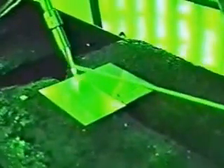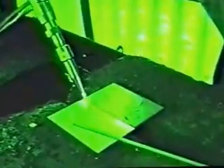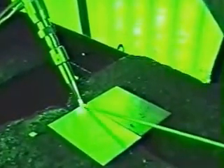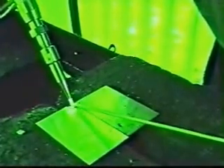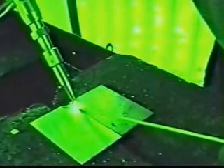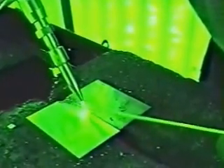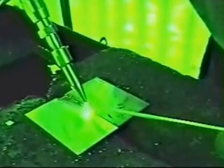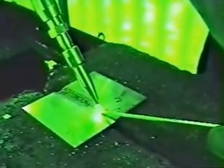On the aluminum, it's a little different than steel. Of course, it's not going to turn red — you just get a little wrinkle effect, it looks kind of like jello. Once it gets to that molten state, we want to just touch that rod to that molten puddle. Just dip the rod in the puddle, pull it right back out. It's very similar to a TIG weld.